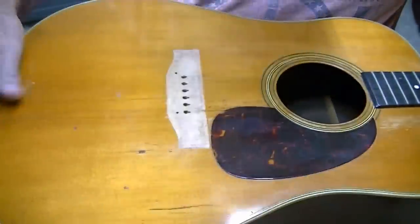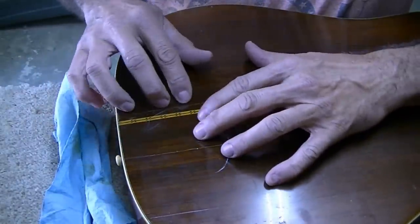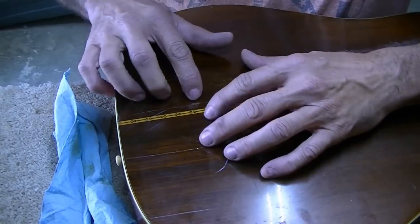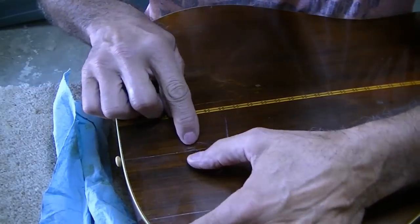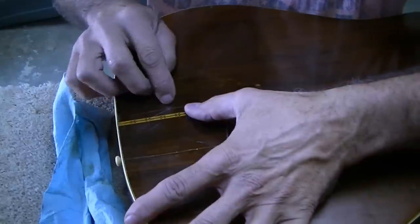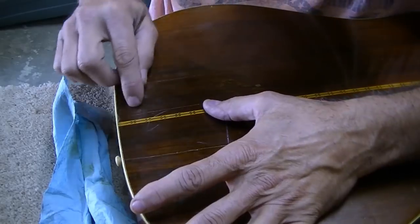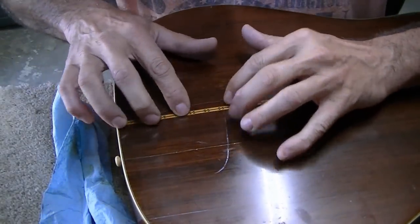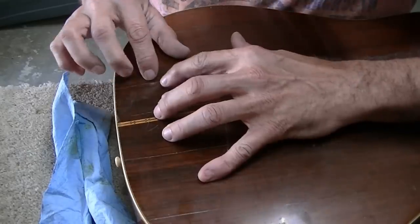I could go ahead and glue the bridge on, but while I was at the buffer I got to see the back a little bit. There are cracks all through this back. They don't appear to be loose — I don't see movement in them. I'm going to look at it real critically and see if they've already been glued. It looks like they may have. I kind of see glue in there, or it's where the finish is just curled up — hard to tell. But since I don't see any movement, I think they've been fixed.